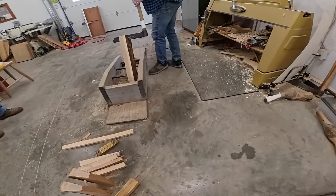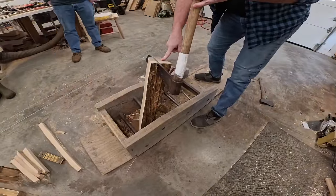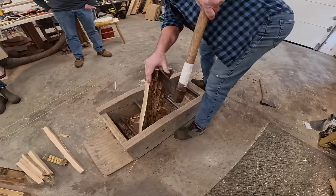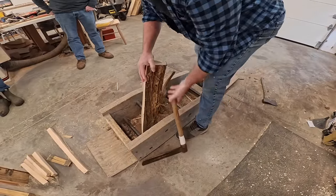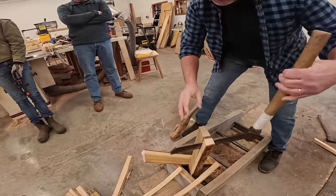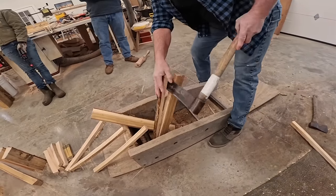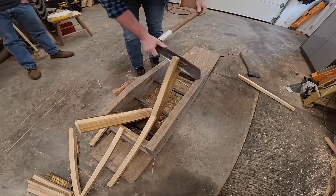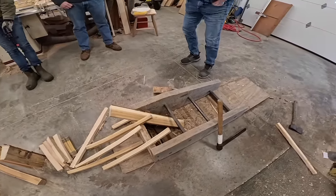So we have a brake box here. You always pull the handle to the thicker side because the fulcrum down low puts more pressure on this part, and you can hold back on the thinner part. You're just trying to equalize the pressure so the split will run straight. Some people use the sapwood — the reason I don't is I've had issues with it in the past. I definitely wouldn't mix them in a chair. That's how we get perfectly split pieces.